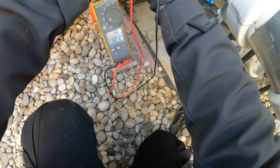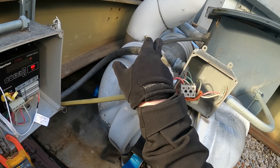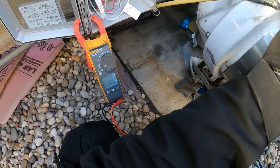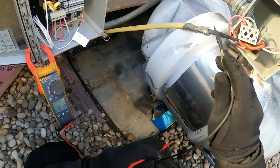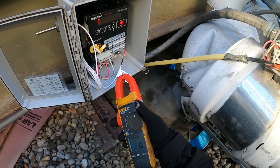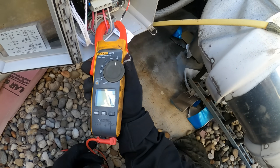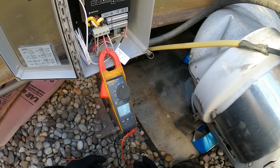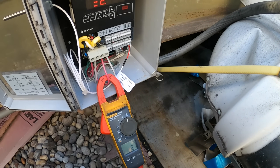Checking between C and D, we have 121 volts. I followed those wires into a harness and a connection block — 120 volts in, 120 volts out, feeding the heating cable. Checking amperage on C and D: D shows 2.1 amps, C shows 2.2 amps. The controller reads I = 2.2 amps.